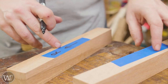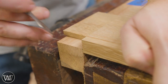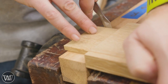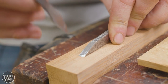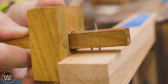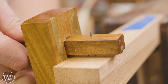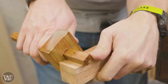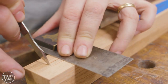At this point I want to redo all my marks so that I know which way is up and which way is down. Now that I've cut the tenons, if my tenons are a little sloppy that's okay as long as my mortises match the tenon. So we're going to set reality here — I'm going to slide the stretcher all the way up to the top of the leg and then mark off the sizes of the tenon. I'm going to put my mortising chisel on the board and mark the width of the mortising chisel. I actually made the tenon to be the same width as the mortising chisel, so I can then set my pins from my mortising gauge up to those marks, as opposed to trying to balance the mortising chisel on to the end of the mortising gauge.